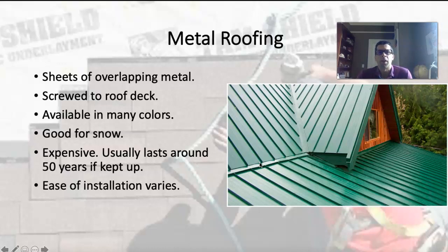One big benefit of metal roofs is they're really good for areas with snow load. Snow won't cling to it as easily — it will want to slide off. And because it doesn't have a whole bunch of seams all over the place, if the snow melts and refreezes or does something weird, it can't creep into the seams and get underneath the roofing material. It's pretty good in that regard.